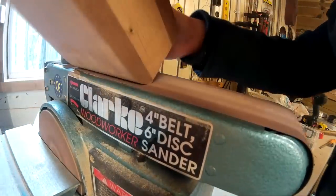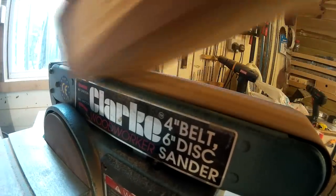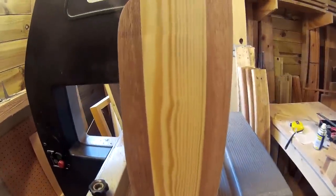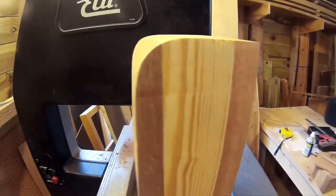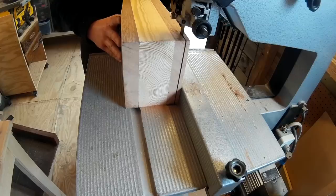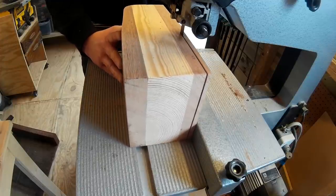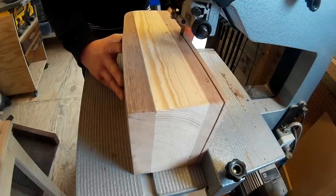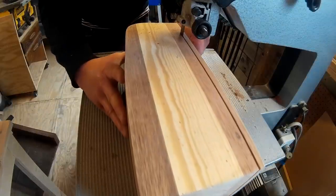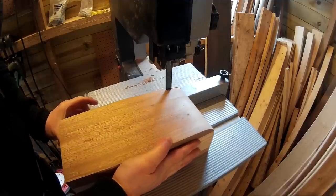So the project had evolved a little, but as it was my first attempt at making a bandsaw box I kind of knew it was never going to come out perfect anyway. With that done I set up the fence again and cut off the new rear panel on the bandsaw, and this time the cut was really good and straight. Then I cut the side panels in the same way.